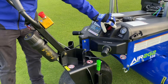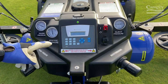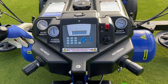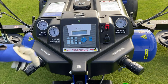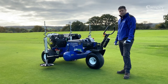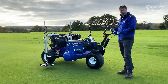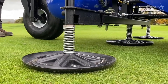Turn the computer on, lift the little red tab and switch it on. It'll say 'select mode' — one for auto, two for manual. Always press one for auto. Make sure the pressure is set around four bar to start with, and the injection pressure is set around 20 to 25 psi. Now the computer's on and ready to run through its cycle. It's going to push the beam down, fire three probes into the ground, and inject twice. So if it finds a hard layer, it'll inject there and carry on going down and inject again.